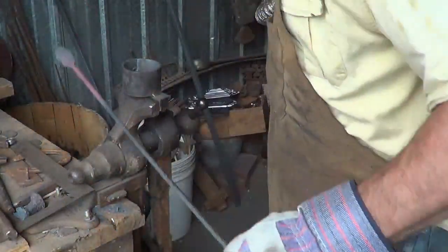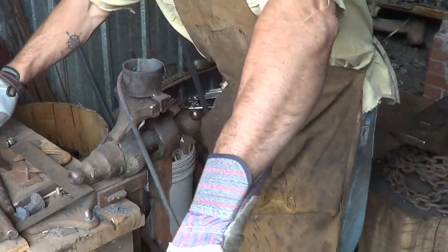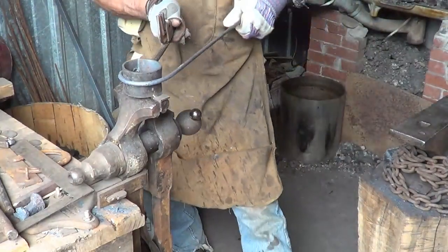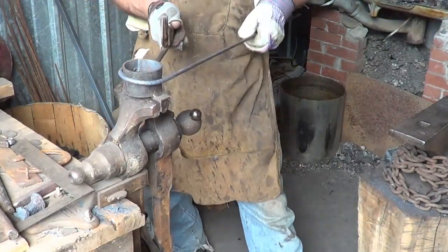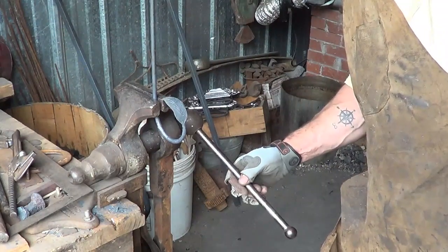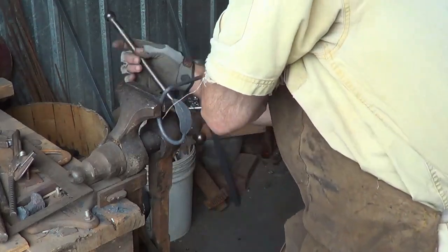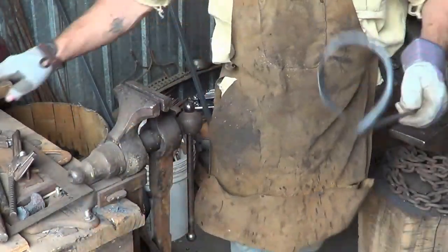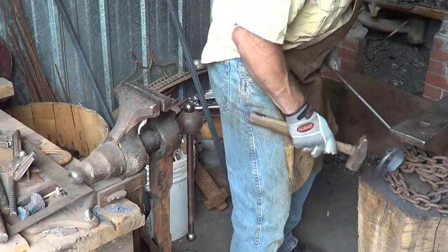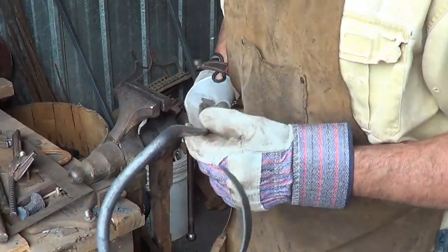You don't need a crazy amount of heat for this next move, but enough. I just come around my mandrel like this — I put the thing down where I want it. What I like to do is hold this leaf in a particular spot. These are all things you'll learn as you do them. Come back a little just to stretch it out, and then come back where you want that 90 to be. If you go a little too far, come back — it'll give you a nice clean corner. Get the shape that you want. On the anvil I go ahead and just square everything up so that I'm happy with it.